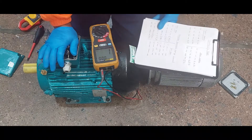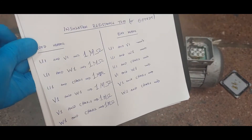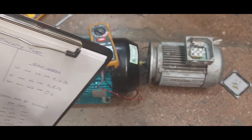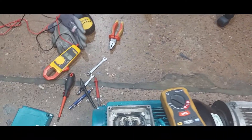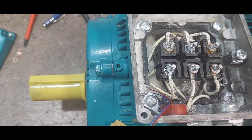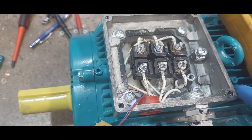That is how you test your electrical motor — that is the difference between a good electrical motor and a bad one. You can also see other tests in my other videos about how to test electrical motors. There are three major tests: first, do a visual test — if you open the motor you will see rust due to water damage on the inside. Also, remember that before you do all these tests you have to remove the configuration plate, because the motor might be in star or delta configuration.